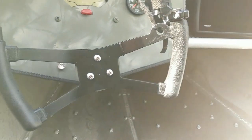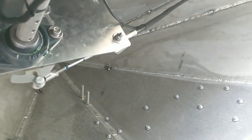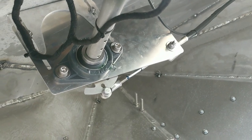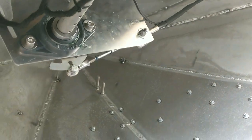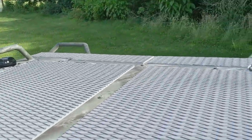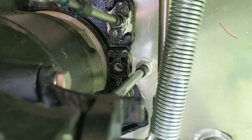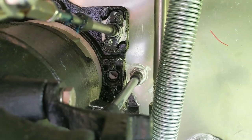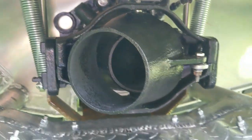All right, so I finally got the steering system installed. I ended up using MiniJet's bracket, and it turned out amazing. It was very simple to install and adjust, and I've got a 13-foot cable from MiniJet as well, and that's the cable that's long enough to go through the gunnel and then back and connect to the steering linkage back here. So it's just a hole drilled in the transom and then sealed with some Sikaflex, and yeah, just connected to the nozzle.